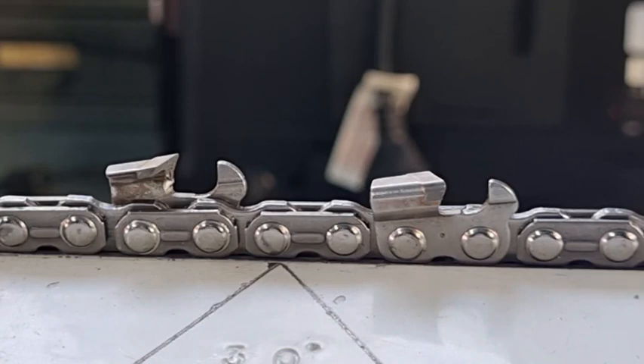Typically the sharpening ratio would be: if you sharpen your standard chain 10 times, you'd only sharpen this maybe once. So you don't sharpen them a lot. You do need a diamond wheel to sharpen them — if you don't have that, take it down to your local shop. They'll probably charge you a lot more because it's a lot slower doing it.